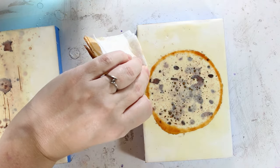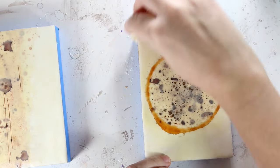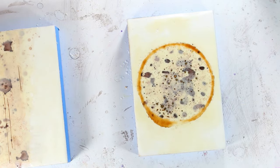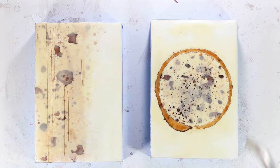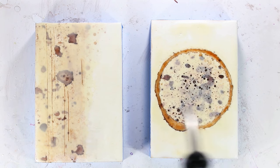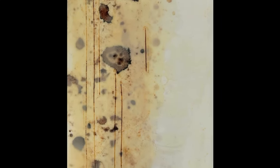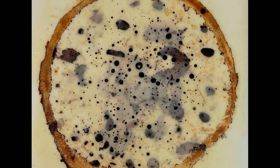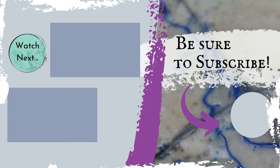Here I'm wiping away some of the excess rust fairly cleanly. Since I'm not adding more wax, I'm doing a final fuse on these two pieces just to make sure the rust is encapsulated by the wax even without adding a new wax layer. My torch worked really well for this — it lit up some of the steel wool fibers a little bit, but as long as you're careful that's not anything to worry about. The wax soaks into the rust on the final layer without diluting the color. The results are pretty fun — this is a great technique. I hope you try it, let me know how it goes!